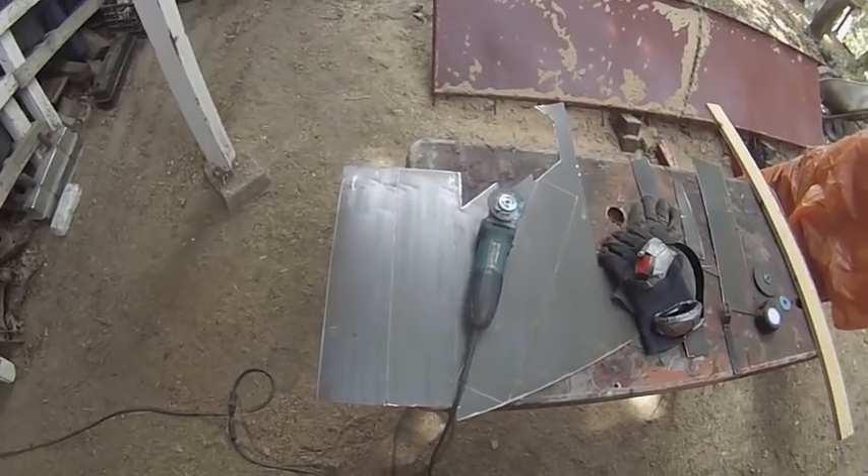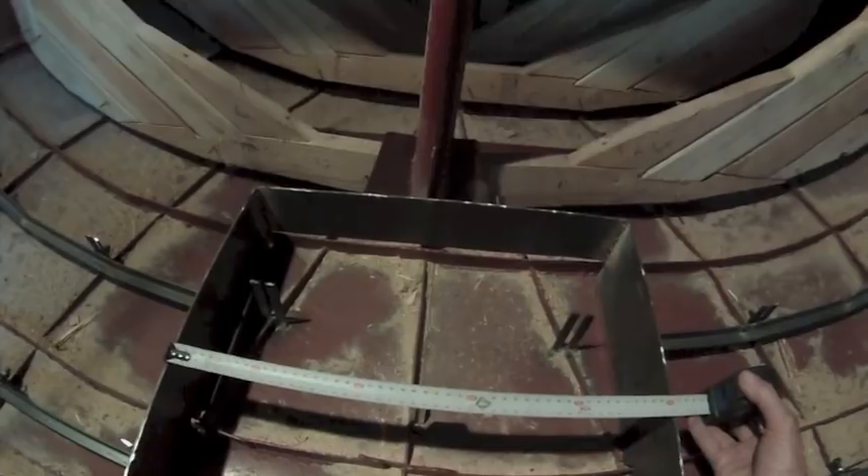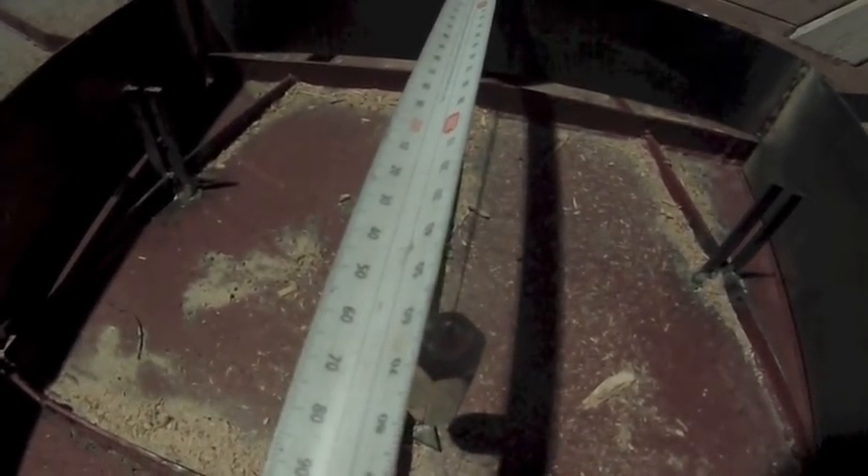Here I'm cutting out the pieces for the mast step. I hung a plumb bob from the ceiling via a magnet, and this turns out to be the center of this box. So if I run the tape measure across — I've already pre-measured where that center mark is — I line up right on the thread, and then this way as well. There's the mark; you can't see it but I line it up, and I'm almost there on that side. There's where the mark sits — the thread is about a millimeter off. It's good enough.